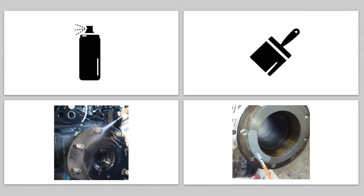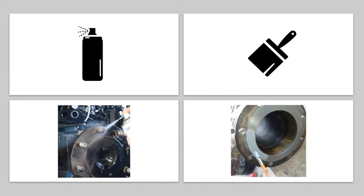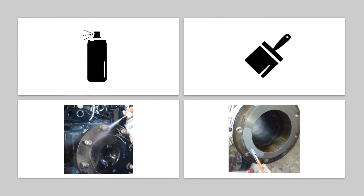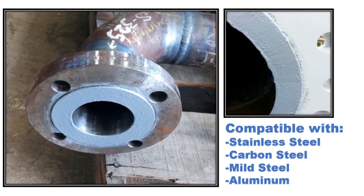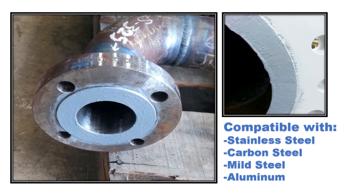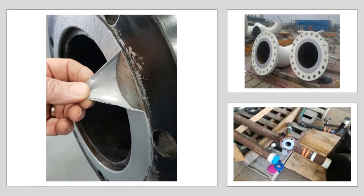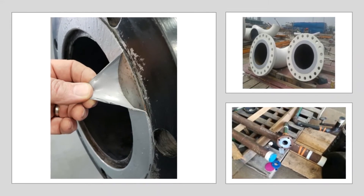Let's look at the pros of using flange face coatings. The biggest pro is that these coatings are very easy to apply — they can be painted on with a brush or sprayed directly on the flange face, making the application time really fast. Another pro is that the coatings with rust inhibitors do an incredible job at preventing corrosion, and most are compatible with all types of metals. These products also tend to dry pretty quickly, so you don't have to wait around. Also, coatings are offered in a wide variety of places, so they are readily available and easy to purchase.